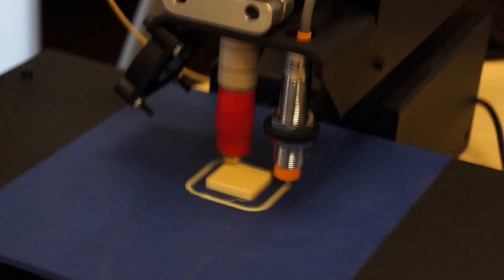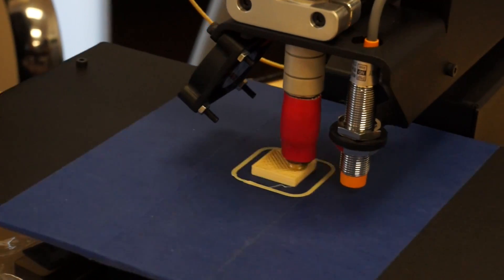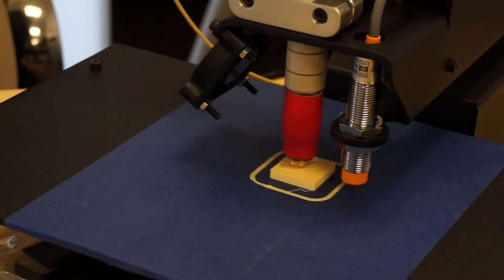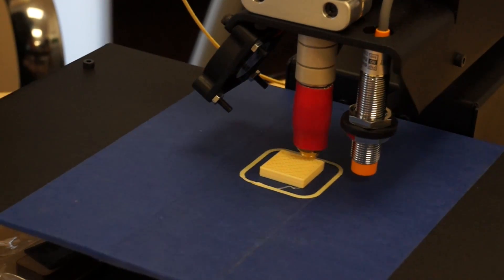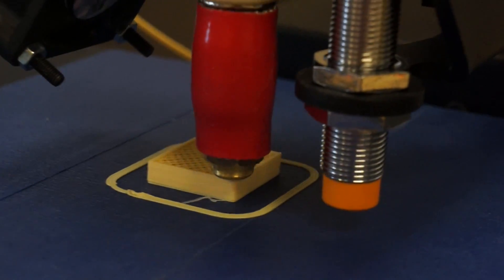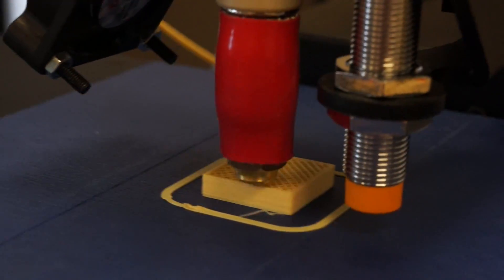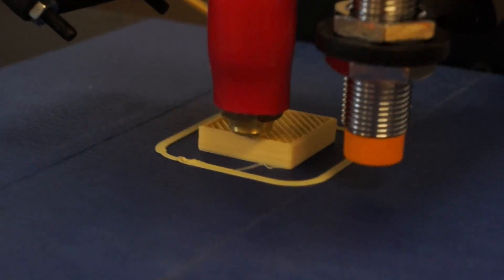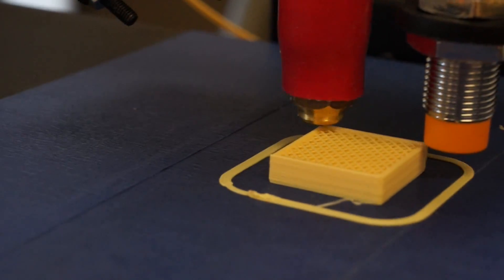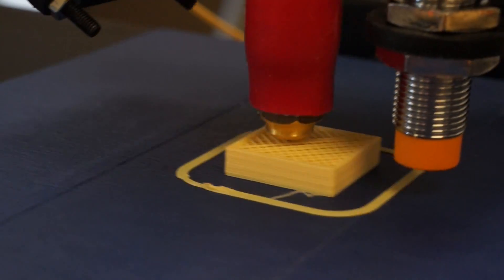After that skirt, we've got a solid piece going there. We are off and printing — we've calibrated that Z height for the auto-level and it's going very well. Now we're ready to move on to something greater than a cube, but good luck, and take care of your printer by calibrating that Z before you print your first object.